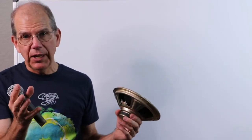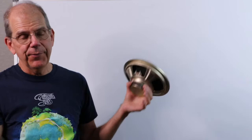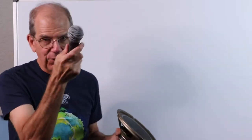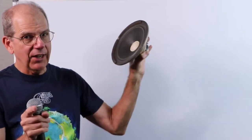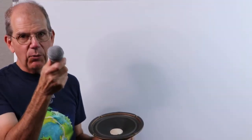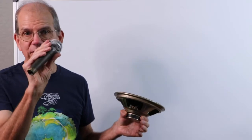Old fashioned push-to-talk intercoms typically did this — they had one small loudspeaker, and in one direction it was hooked up like a microphone, in the other direction as a loudspeaker. Can you do the same thing with a mic? Theoretically, but they're really designed for pickup, so you're not going to get a very loud output before you destroy the thing. Don't try to use this as a loudspeaker. You can experiment the other way — you can use a woofer as a mic and you're not going to hurt it. The diaphragm in a microphone is very lightweight and fragile compared to a woofer diaphragm, but it's essentially the same stuff: there's a magnet, there's a voice coil, the diaphragm, the surround — it's really all the same, but skewed toward picking up sound. That's how a dynamic microphone works.